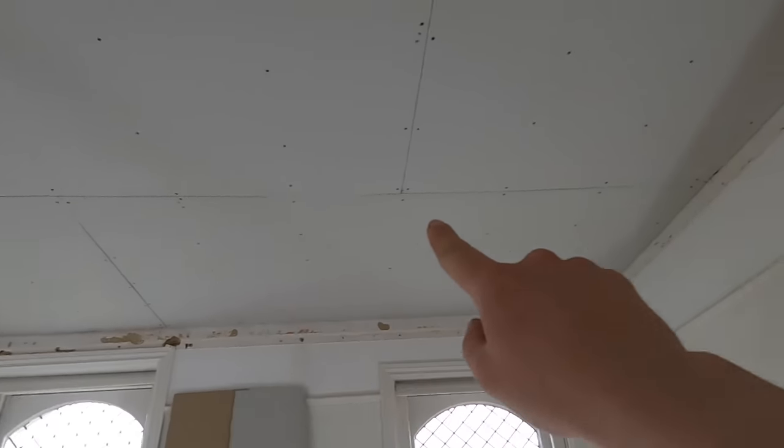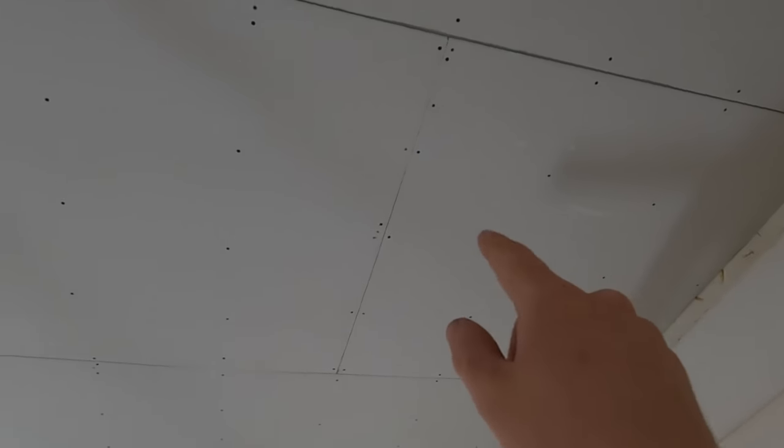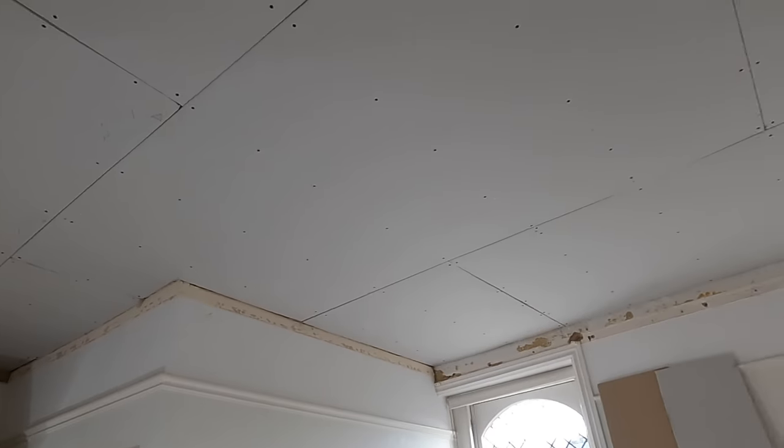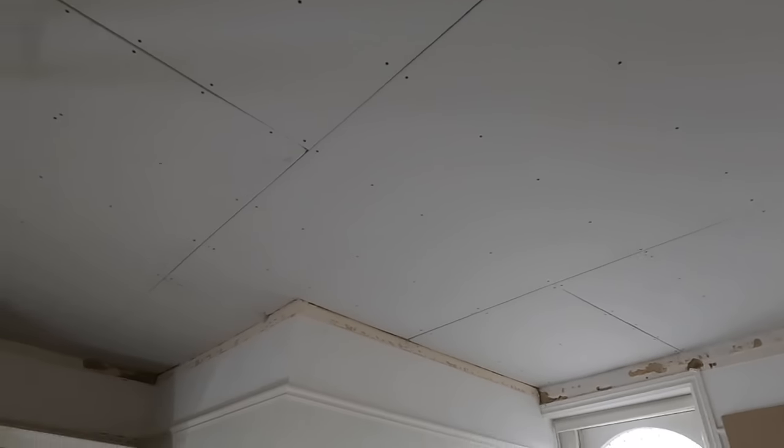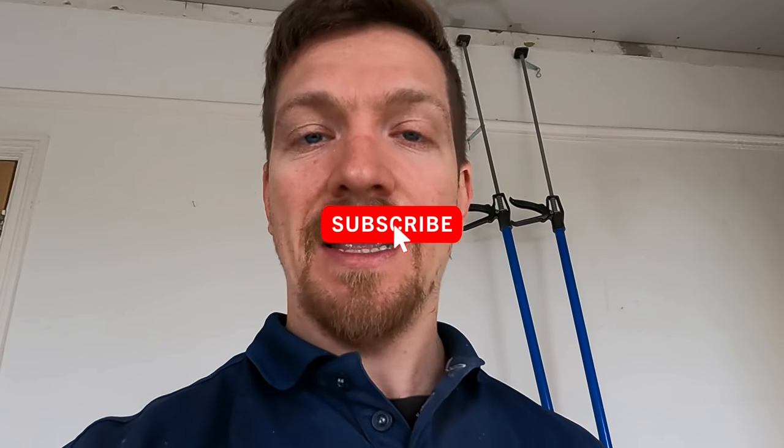With that, we've now got staggered joints running through — which minimises cracking. If joints run in line everywhere it's more likely to crack in those areas. When plasterboarding: full board, cut, off cut to fill the gap, full board onwards. Ceiling all boarded, staggered joints, nice cuts, ready for plastering. If you like this video please hit the like button and subscribe. If you want to learn how to plaster the ceiling and see the full process of skimming, feel free to join our free welcome course or watch one of the playlists coming up. Thanks for watching.